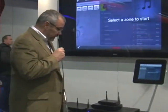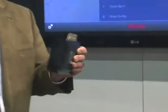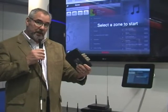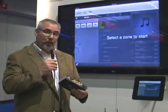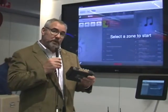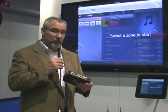But along with the P3100 are these two pieces, the P100 and the P200. These are individual zone amplifiers that can be placed directly in the room. The advantage of these is they are Wi-Fi, so they can communicate wirelessly. This one, for instance, is a 40-watt zone amplifier. I would connect it directly to speakers. I have a line in and a line out on each one of the zones. Each one of our zones also has a USB port, which is a very easy, wonderful way to interject music into the system. All I have to do is put all of my music content on a USB drive, plug it into one of our zones, and our zone will see it, scan it, and then it becomes part of the music library. It really is that simple.